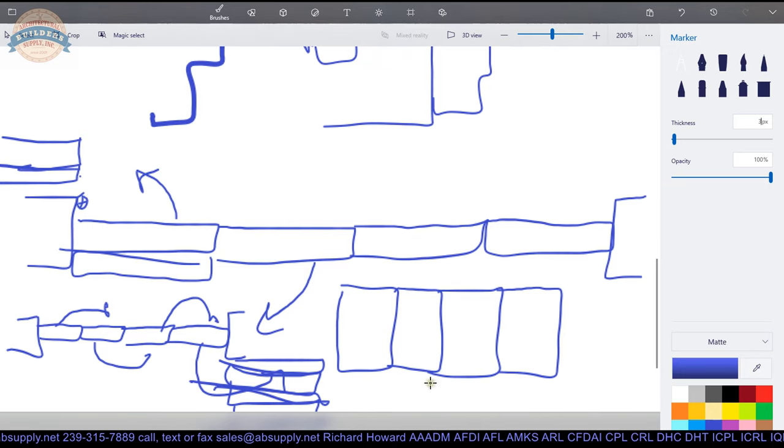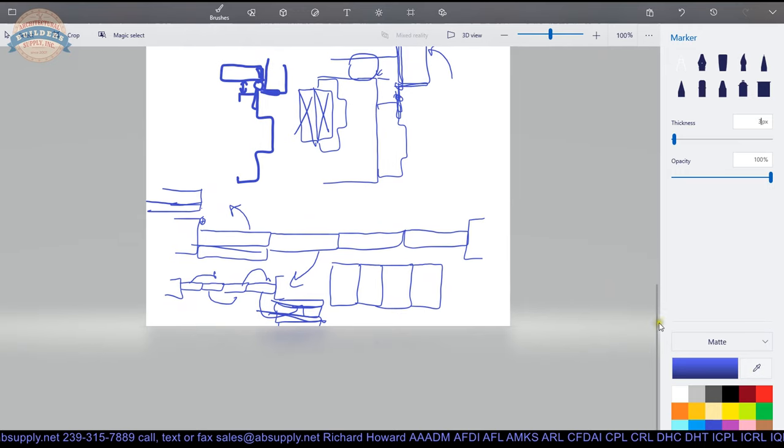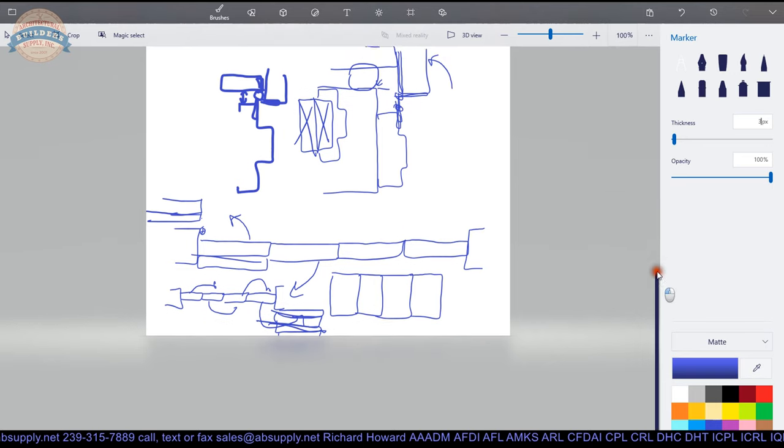You've got to be mindful how much weight is happening here, because the hinges here are going to be really troublesome. You might want to pivot on that end of the opening if you're going to stack all those doors. But these are a couple of extreme examples that illustrate, 99.99% of the time, you don't need to think about the width of the hinge.